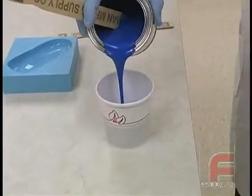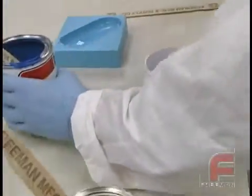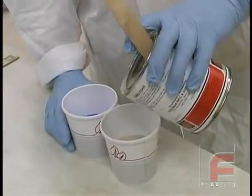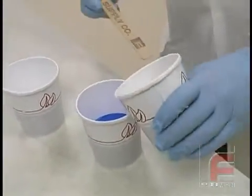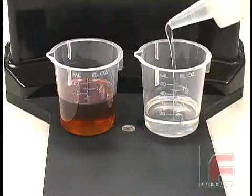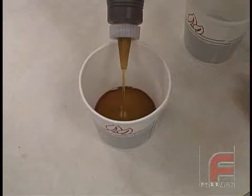One of the advantages of a 1-to-1 mix ratio material is that it can be measured without a scale. All of our Repro Fast Cast Urethanes and a few of our Freeman Polyurethane Elastomers can be weighed and mixed using this three-cup procedure. Here we poured enough material of each side into two lined cups and visually verified that each cup has about equal amounts. Then we poured the material from one side into the other and mixed it with a paint paddle, making sure we scrape as much of the material along the sides of the cup as we can. If more precise measurement is required, we could use cups with graduated markings or use a ruler to mark equal heights in both cups prior to pouring, but in most cases this isn't necessary.